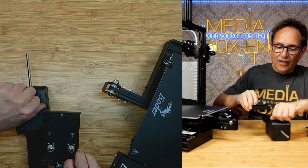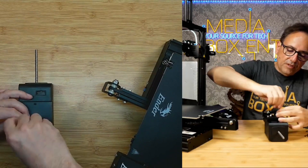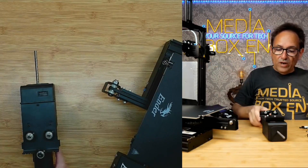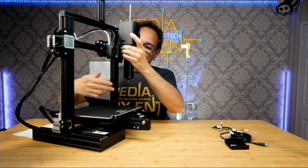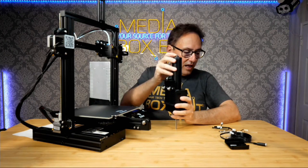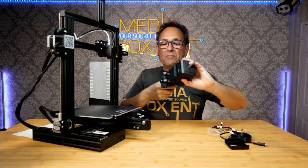Let's get the Allen key and tie that up. That's the power connection going to the main board. Now check this out — mounted this way, I have four to five inches of clearance. There are two tip options: a metal tip or a plastic tip. The plastic tip costs you about another inch of height. I think this mounting method is better, and there are three screws holding the plate instead of two — much better.